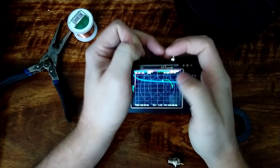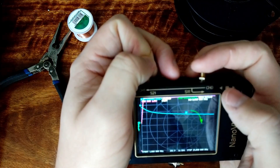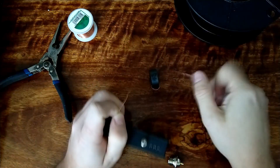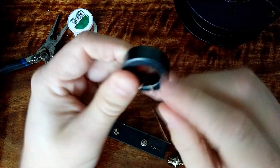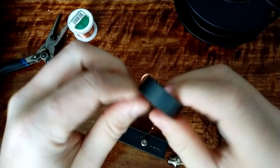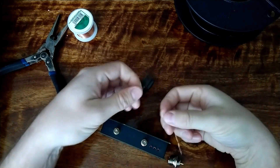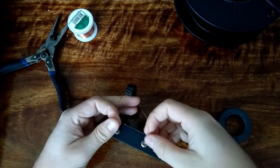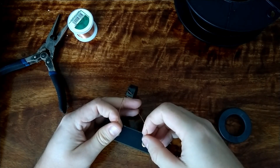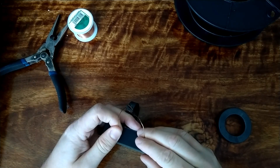I was showing you the wrong channel - I should have had trace one. There we go. Negative 14 dB. I'm not really sure how much you need for a transformer core, but I'm going to do probably six windings for good luck. We'll go up to six and see how much choking impedance that gives us, and that'll be what we use for winding our transformers.